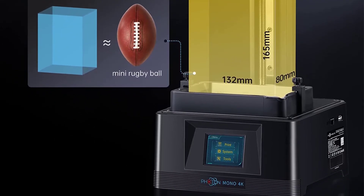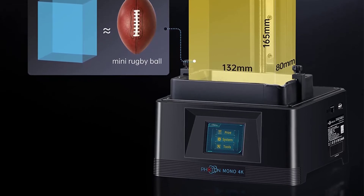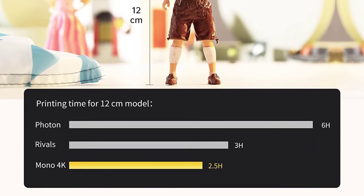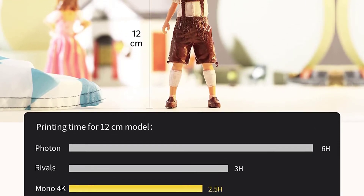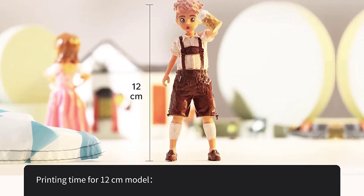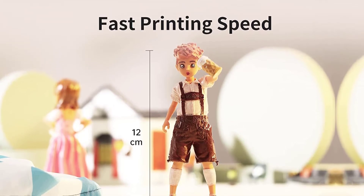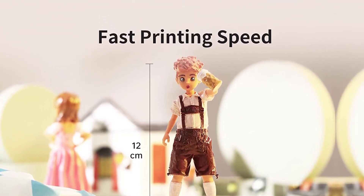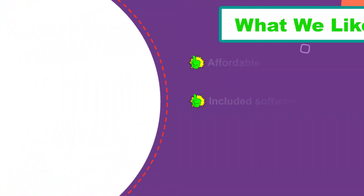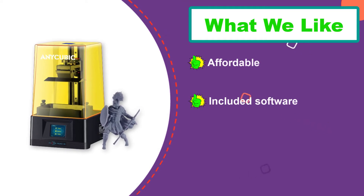There are only four settings you need to adjust out of the box, unlike most other 3D printers which often require full assembly and lots of settings tweaks. Despite the fewer settings you're not making any big sacrifices — the resolution is reasonably high with good accuracy and smooth detail, with XY at 47 microns and Z layer height down to 10 microns. This provides a smoother finish than a low-end filament printer would.